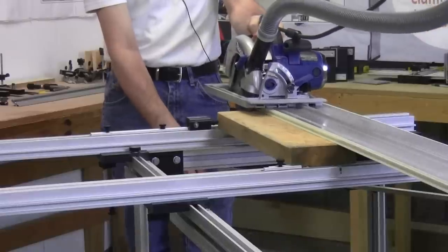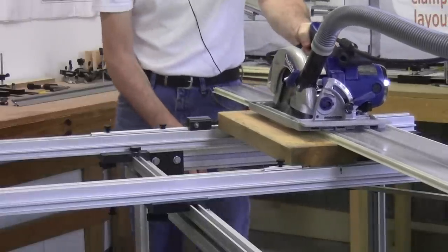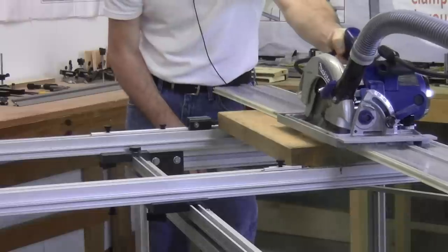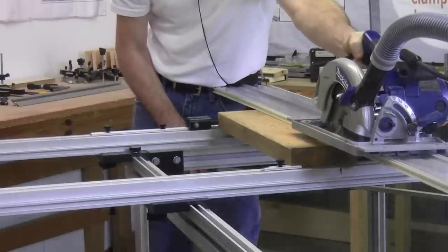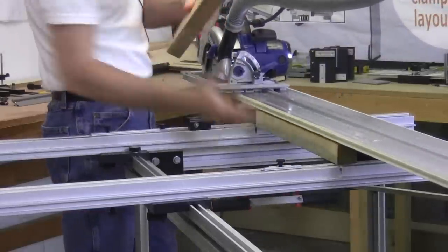We're going to first take this 2x6 material and we're going to cut it down to a uniform size of 1.5 by 1.5 inches. And we'll start that by doing a rip cut. And then from there, we'll then create our four tapers to finish this leg off.